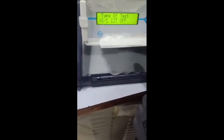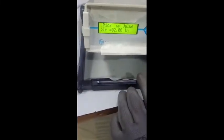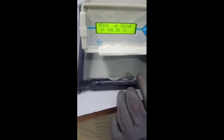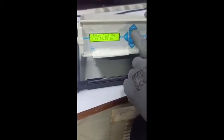Now select the type of test as instantaneous — instantaneous selected, press enter. The test value — scroll down — it is six times, set it to six. Test current to be set at nine point five times. Now we have set the test current at nine point five times and we'll go for the test.